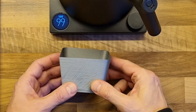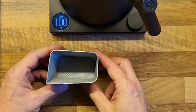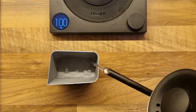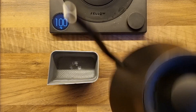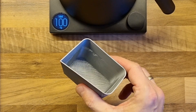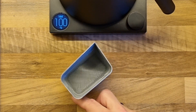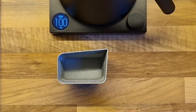You can see the water is boiling, and here is the container I've printed — single layer vase mode. The print temperature was a bit high, but let's see if it is heat resistant. We have boiling water poured into this single-walled 3D printed container, and yes, it is watertight and heat resistant — so we can say it's boiling-water-tight. The walls softened a bit but still kept their shape, so it proves the point.